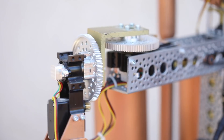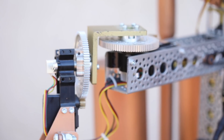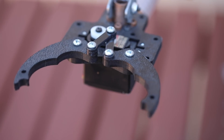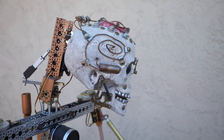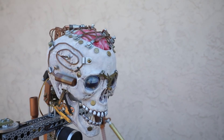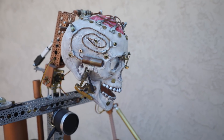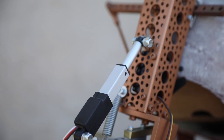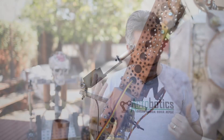He does use 13 servos. He uses four servos in each arm — two in the shoulder, one in the elbow, and one in each gripper. We have two different grippers that we use. He uses three servos for his articulated three-axis skull, as well as a linear actuator from Actuonix to provide the tilt. We wanted that extra torque and preferred the slower motion from the linear actuator.